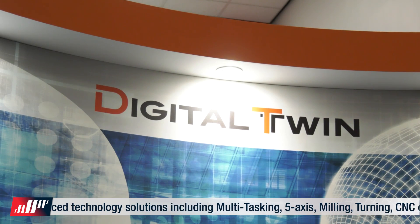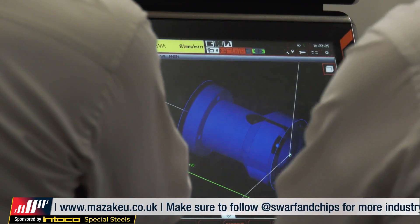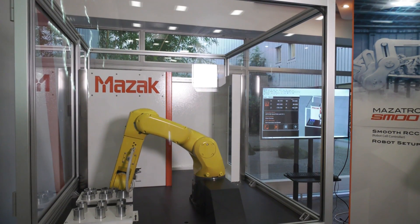That's one of three pillars — what are the other two? The second is digital twinning: the ability to take a copy of the machine tool and move it into the office environment — not just moving programs, but programs, fixture data, tooling data, solid models — everything needed to efficiently program the machine tool in the office, then transfer back to the machine. The third pillar is automation: Mazak have made a big stride forward in making connecting robots to their machines much simpler and more fluid for operators.